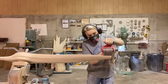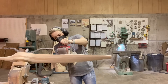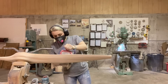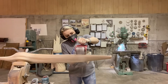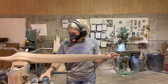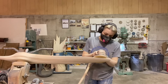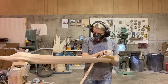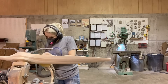When I belt sand I'm really just trying to take out all the saw blade marks, but I actually leave a few in. A lot of people ask how I know when to stop or how I avoid taking too much off one blade versus the other — I use the saw blade marks to determine that. I'll take almost all of them out but not all of them, so I might have like 10 little spots showing. Then when I sand the other blade I stop at roughly the same number of spots, and that's how I know I've sanded an even amount on both blades.